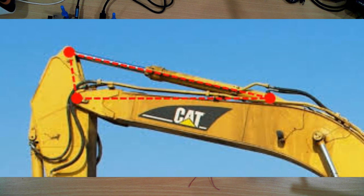We touched on this briefly in the second video. Using a piston type joint, you can use a lever arrangement where you push on the back side. You can also choose to have your connection point for the piston further away from the pivot point — the further away it is, the more torque you can generate. If the piston produces one newton of force, at one meter out from the pivot point you'll get one newton meter of torque.